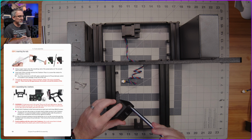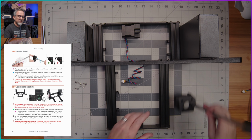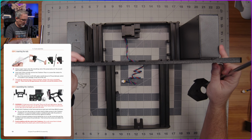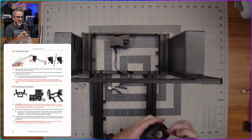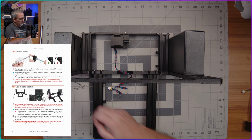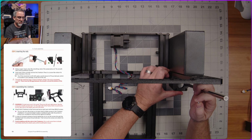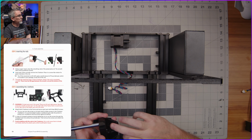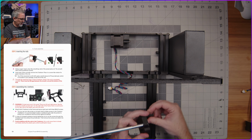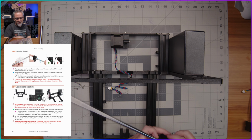So this one here, there's this little triangular extra tab here that sticks out the outside of the printer. So I know this is the right side, and we'll get this centered under the camera so that you can see there are 3 holes here in the upright part of the metal frame that this will screw into. So the idea is to go through these 3 holes right here with our M3x10s and screw straight through and into that metal piece.